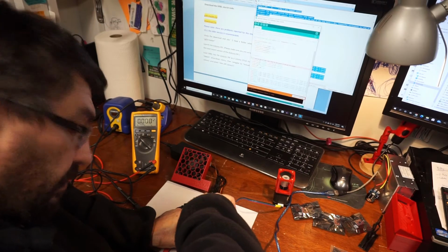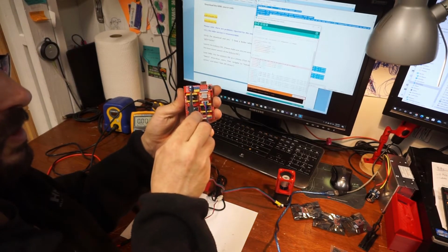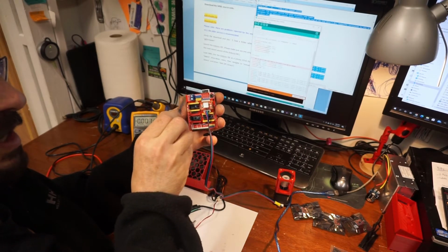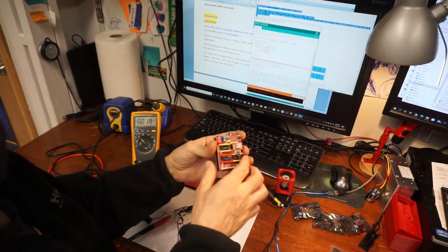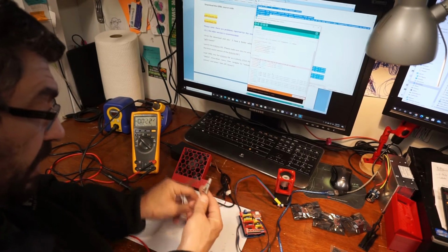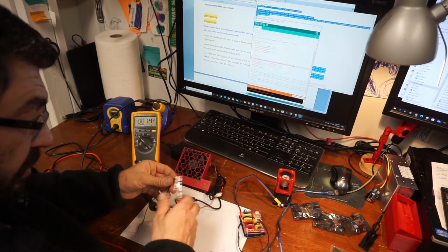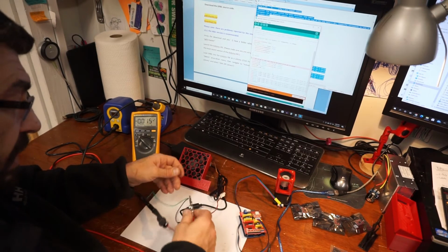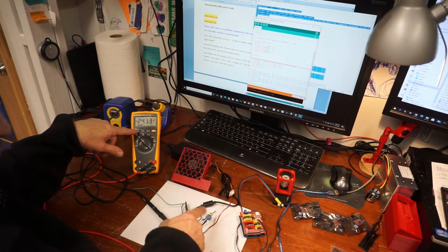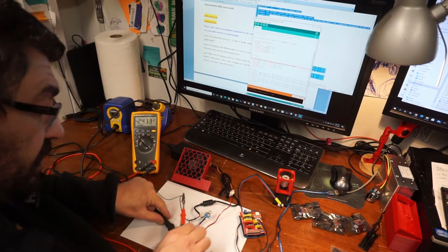put the wires into the Arduino, the power. So let's just loosen those up all the way. Now it's important not to reverse the polarity here, or you could really damage everything. So I'm going to do a quick check to make sure that my cables are positive and negative. Just for instance, I'm going to reverse my polarity here, and you'll see the voltage will come out negative when I turn the switch on. And that's how you can tell if you have the right leads.